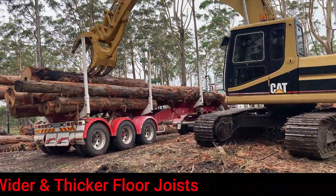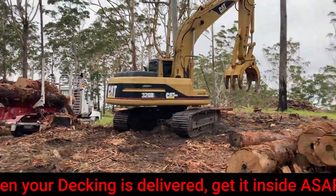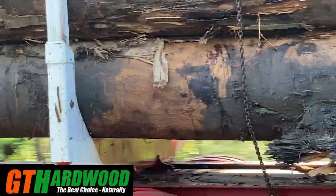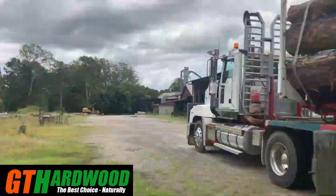The problem I'm seeing starts when the timber is delivered. Quite often it's being left outside. Dry timber left on the ground will take up moisture very quickly, and that's not a good start to the project. You really need to get it off the ground and into a shed of some description as soon as possible.